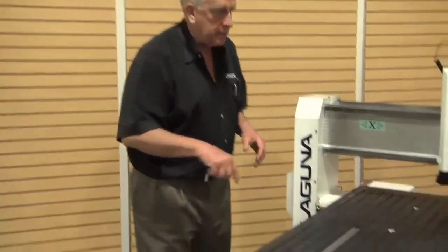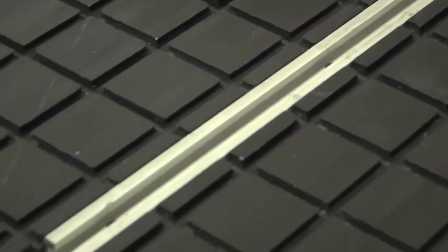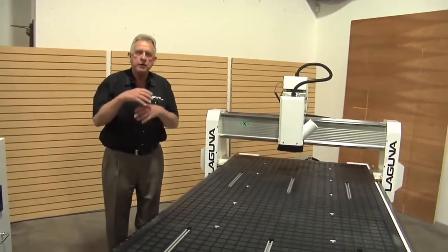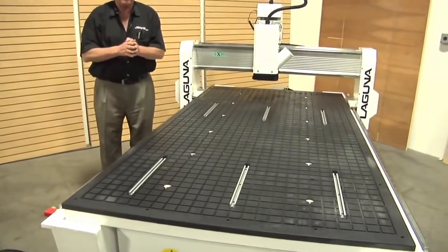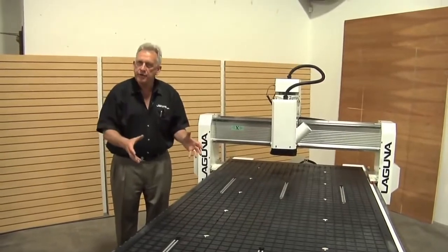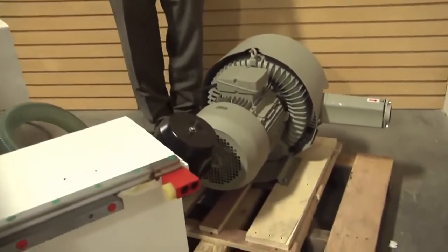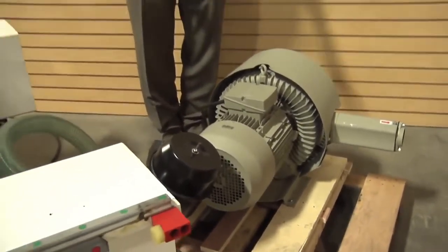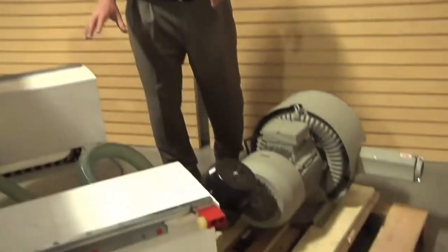The Smart Shop one also has our universal vacuum table that includes a T-slot feature. These grooves allow you to do special configurations on where you direct vacuum. There are also six independent vacuum zones so you can do a lot of special setups. The T-slots are there because sometimes when you're doing 3D files that are four or five hours long, you don't want to run the vacuum pump that long — the T-slot feature allows you to fixture without running your vacuum pump. The Smart Shop one includes a 10 horsepower vacuum pump, and it fits nicely in the space behind the machine so it doesn't take a lot of extra floor space.